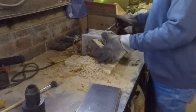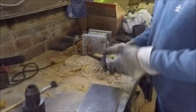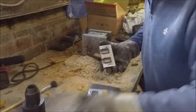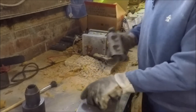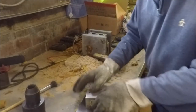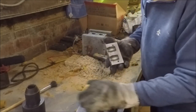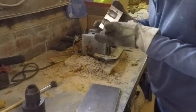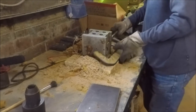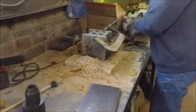Getting there — that looks as if they're pretty well set off. I've found that a smart whack on a steel plate like this seems to help the cores come free of the mold. I always swap them around to make certain they heat evenly. A quick wipe on the jumper to get any loose sand off them, then back between the heaters, tighten the G-clamp, and away we go again.